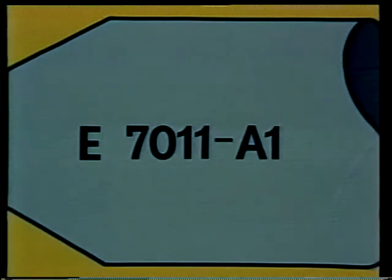Here's the way the AWS code works. The first letter of the code gives the rod usage. For example, the letter E indicates that the rod is intended for electric arc welding. The letter R indicates that it is a filler rod. The letter B means that the rod should be used for brazing. The next two numbers give the minimum strength of a weld produced using the rod.